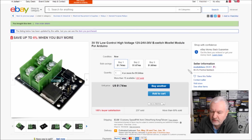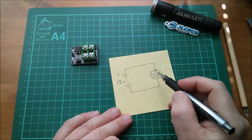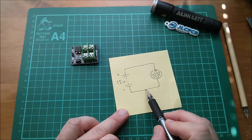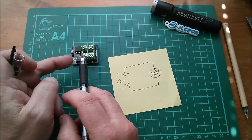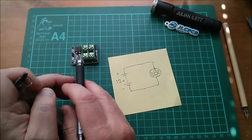This came from Module Fans. I bought it on March the 22nd - it's been in for at least a week, maybe two, so it came reasonably quickly. There's really no description on whether it's N-channel or P-channel, so I'm going to have to identify the MOSFET. I was doing a little sketch of my 12-volt battery and the fan. The relay module I currently have can be placed either in the positive or negative side. If this MOSFET is N-channel you need to raise the gate by a certain voltage with respect to the source - Arduino-type voltage, 3V or 5V.